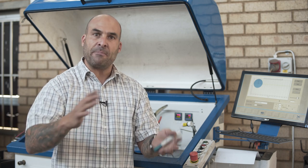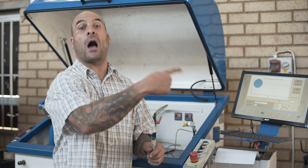When I say prime the turbo, it's for another video, but I'll give you a basic intro as to what priming a turbo actually means. It does not mean take an oil can and squirt oil into the rotating assembly. It's a completely different set of instructions and procedures entirely. So we'll run this turbocharger three or four times to about 20,000 RPM. At engine idle, this size rotating assembly idles at approximately between 10, 15, maybe 18,000 RPM, depending on how high the engine idle RPM is.